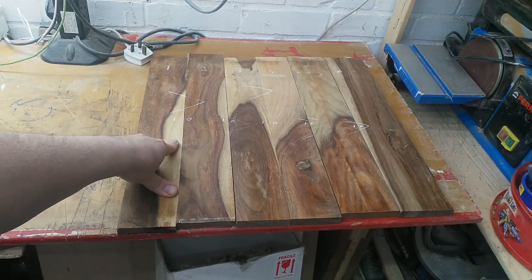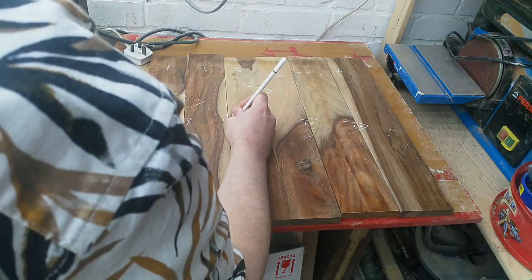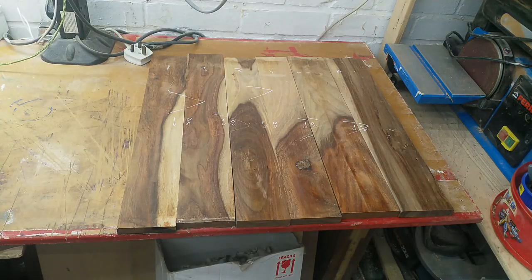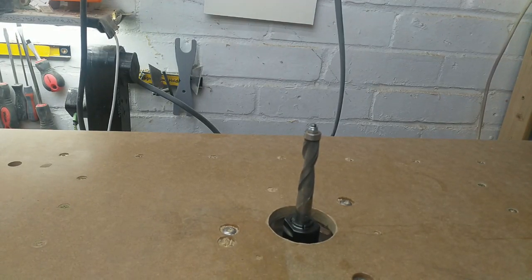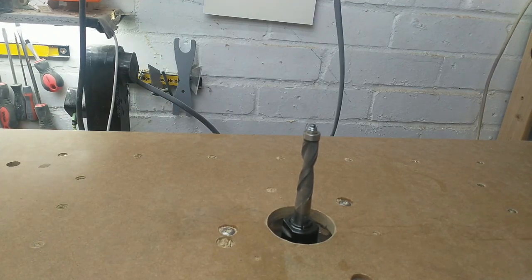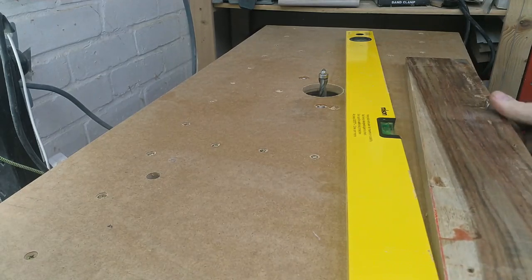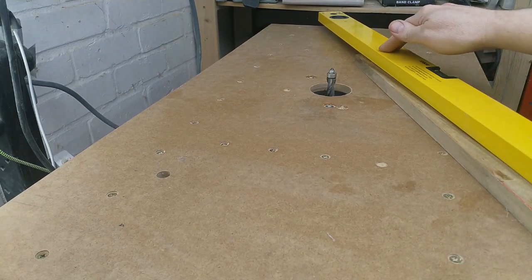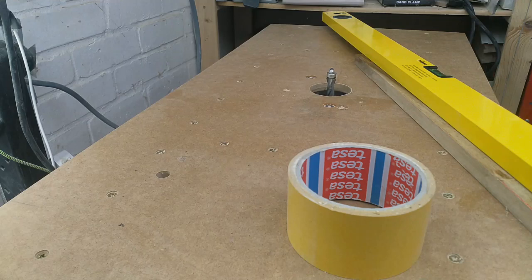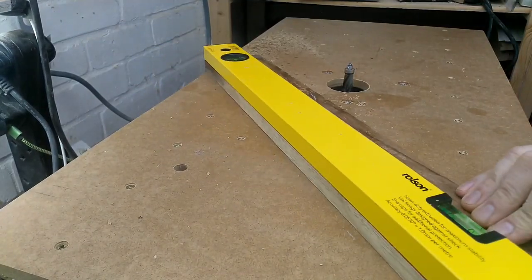I've numbered it to make it easier to remember — in, out — on the router, except it's not going to be that now, it's going to be up and down. I've got my chunky half-inch spiral bit in; there's a quarter-inch one for comparison, so it should get a nice smooth edge. Here's how it's going to go: this says D for down, so this goes down against the bench, and then I put the known flat edge against the flat fence I've got, tape it down with some very good tape — and there we have a flat edge.